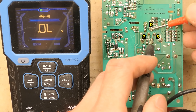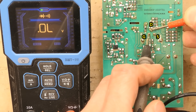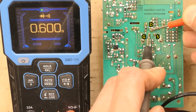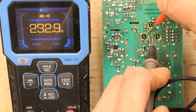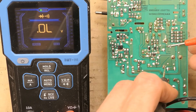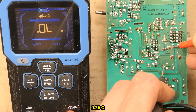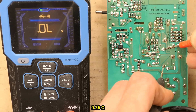The main switching transistor, drain to source — never expected anything else. Looking at the current sensing resistor: drain to gate, gate to source — everything's shorted. All three pins of the transistor are shorted. The current sensing resistor, which is about 0.3 ohms, gets blown to open circuit, of course.